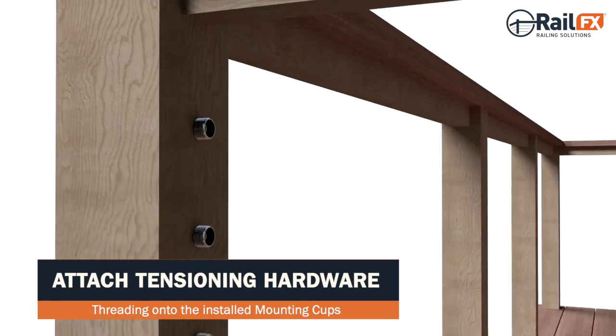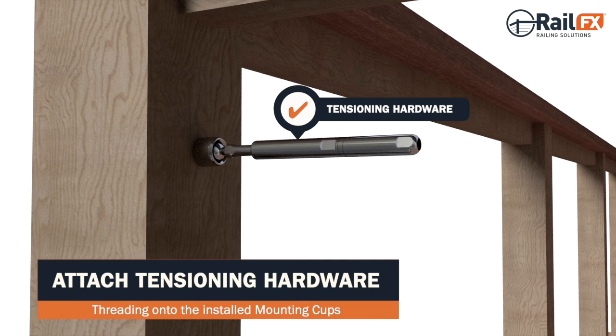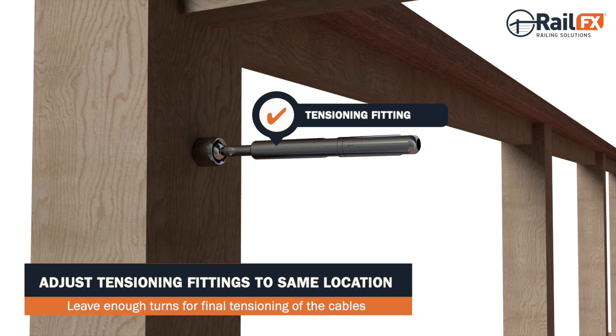Repeat for tensioning hardware at the opposite end of the cable run. Ensure all tensioning fittings are adjusted to the same location and enough thread turns remain for final tensioning of the cables.